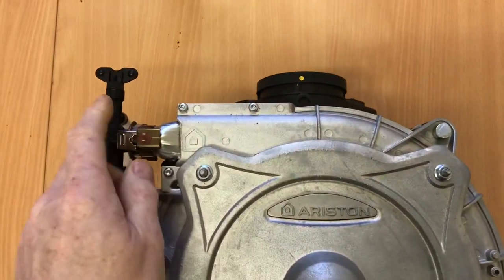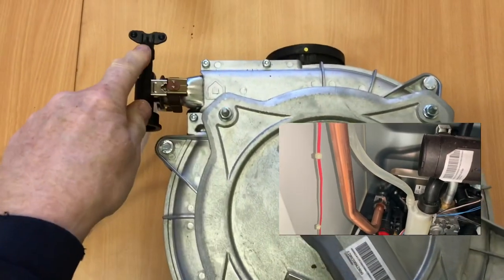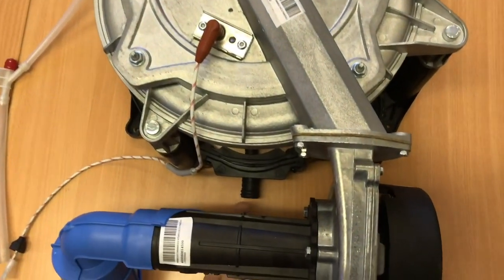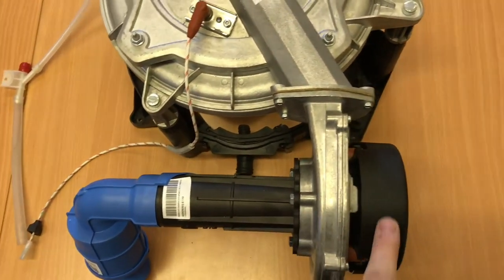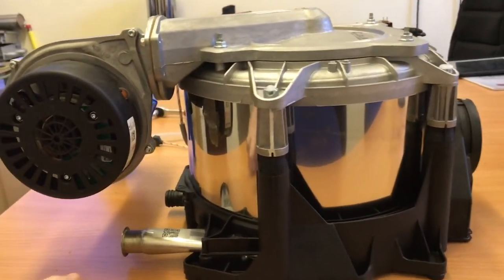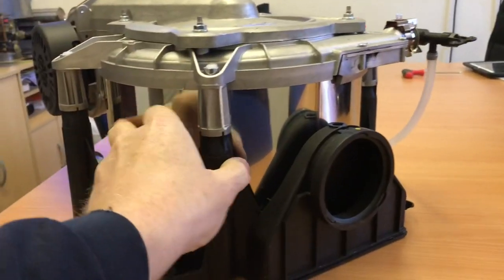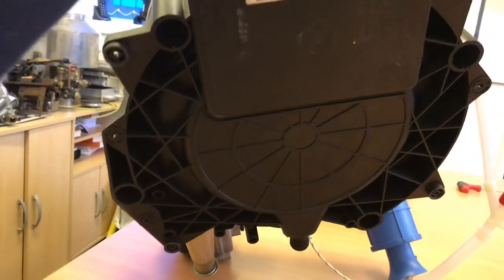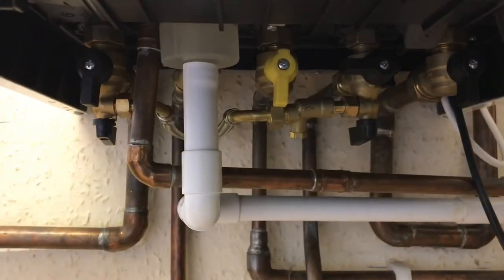As promised, this is the bleed at the top of the heat exchanger which goes down to the condensate trap - that's where it's installed on the boiler. This is our heat exchanger being removed from the boiler. You can see down there is where the condensate goes into the trap, and you can see the silencer, blending tube, fan and other components. On the side of the heat exchanger you can see the return in plastic and stainless steel, and that's where our products of combustion come out. The back side is all plastic as well.